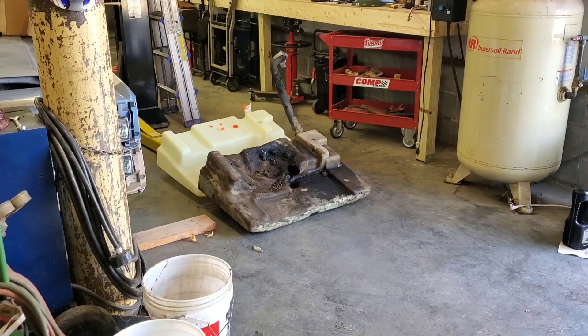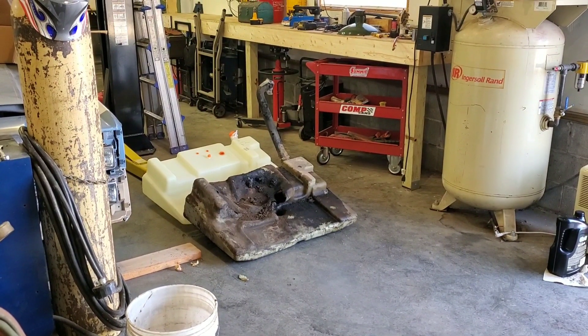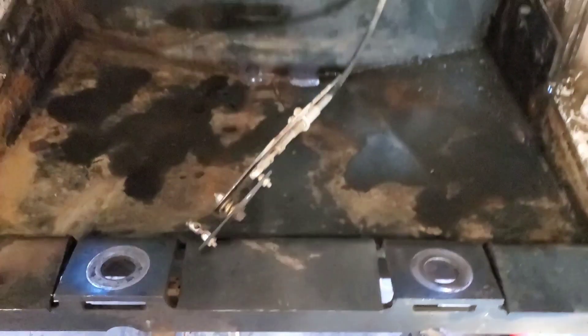See that beautiful old fuel tank over there? It was melted as well. You can see the new one — that's what we'll be putting in here. Back in this bay, there's a one-inch steel plate on each side. You have to get those bolts out and remove those plates to get the fuel tank removed.